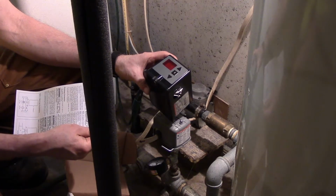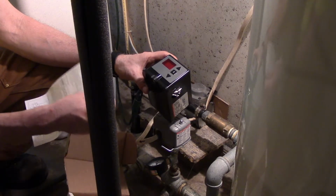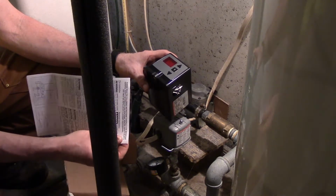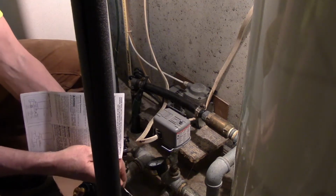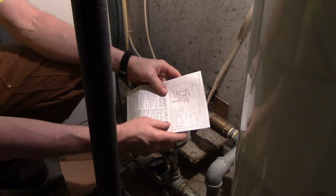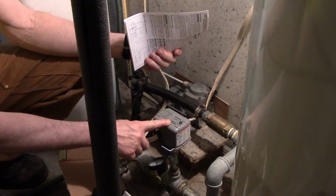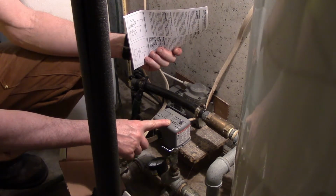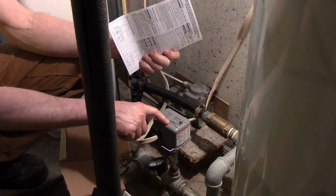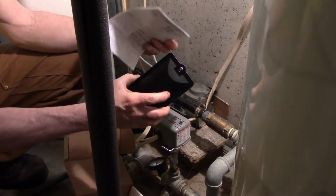There's a pretty good video out there already on YouTube that goes into setting this up. I will put that in the comment section, the description of this video, so that you can look at it and watch that along with mine. It also comes with a pretty good set of instructions. It gives you full wiring detail, and it wires basically exactly the same as the original switch. You won't have any of the clicking sound that you get from the old switch, being as though this is solid state and digital.